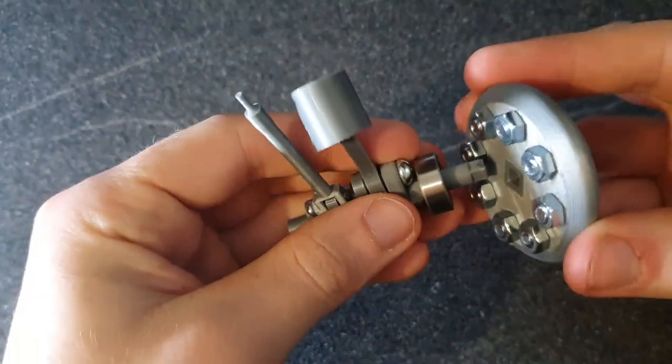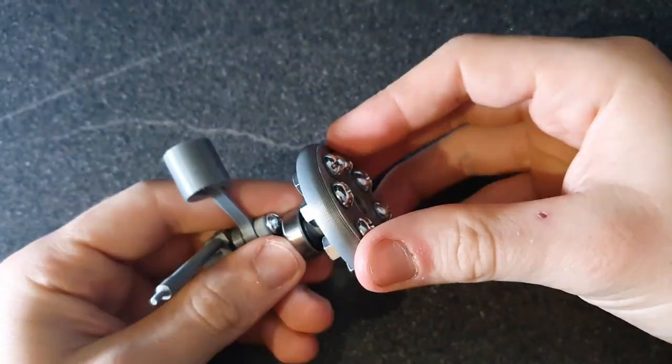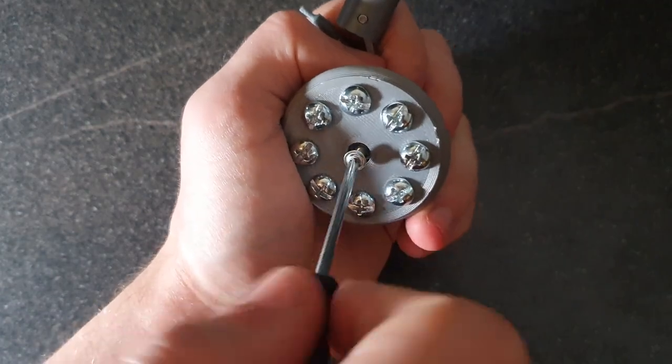I suggested using a non-circular shaft and attaching it to the flywheel by using a thin piece of wire or a paperclip. I took half of this idea by designing a square end on the end of the crankshaft, but instead of using a thin piece of wire or a paperclip I just decided to use a screw instead.